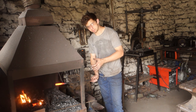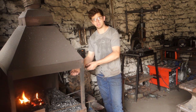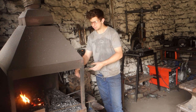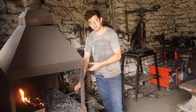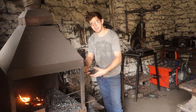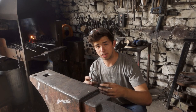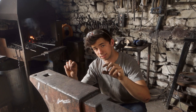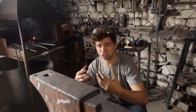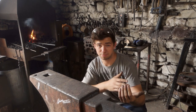I'm going to be using 16mm round bar for the start, and then we're going to cut this off the bar and weld on an 8mm round bar stem, because obviously the head is quite chunky, and I don't really want to be forging 16mm round bar down to 8mm. So I can just do a nice forge weld to get a stem on there, and then we've got to forge weld the two leaves on as well. So I've got to forge out the head first, and it has a step down at the end down to about 6mm round, and another step down at the other side of the head down to 8mm or 10mm round, which is where it's then going to be scarf welded onto our 8mm stem bar.